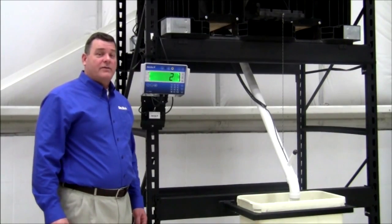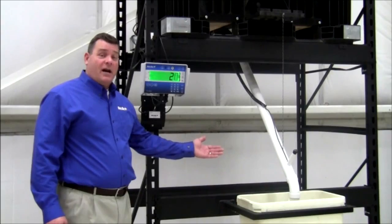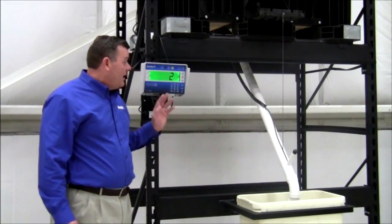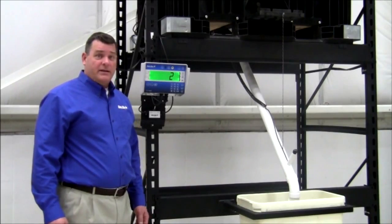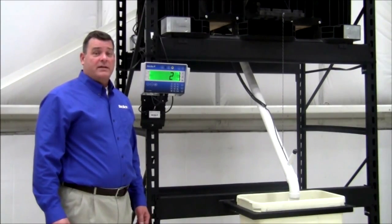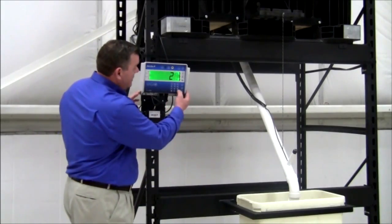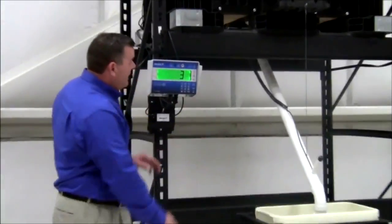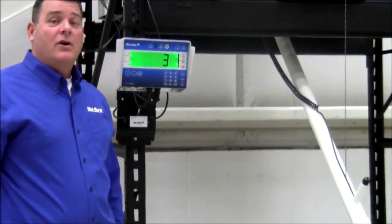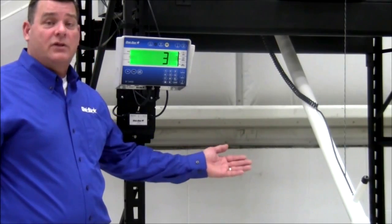Pressing the on button, you can see it displays tolerance — right now it comes out of the factory set at 20 pounds. For example, if you are dispensing 100 pounds and your tolerance is 20 pounds, and the unit is over-dispensing by 10 pounds — dispensing 110 pounds — you want to increase your tolerance. Press clear and enter 3, 0. Now your tolerance is 30 pounds, which changes the amount compensated into your chute.